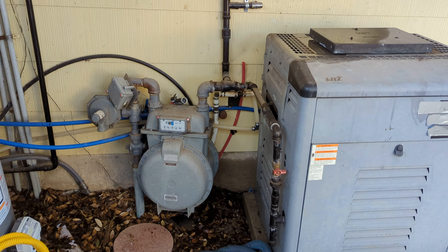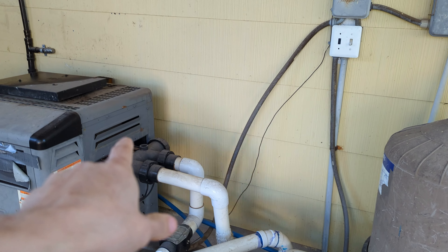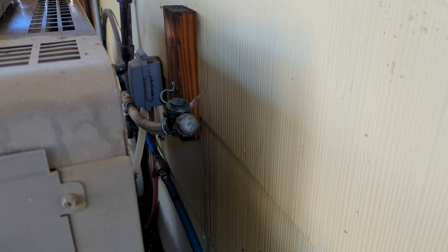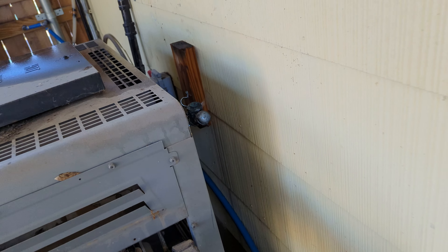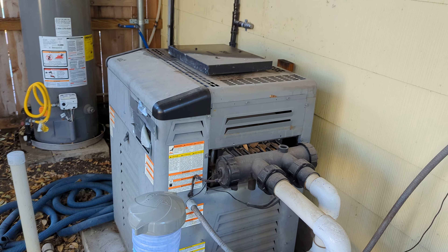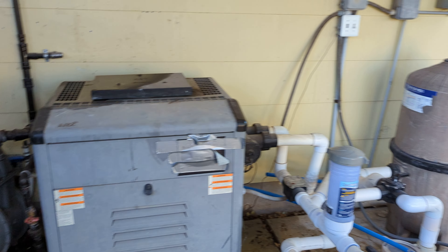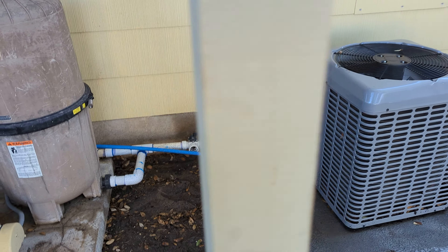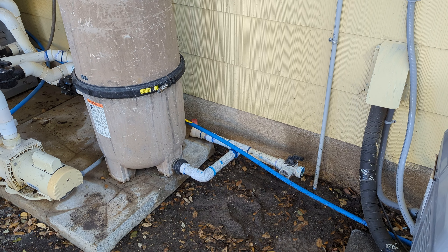So those are all the leaks here. You guys can let me know what you want fixed. For the time being, I'm just going to shut the water off from the main line at the front of the house so we can take care of that leak that's happening there, because that does not have an off valve as far as I can see. That's all puddling up right next to the foundation also. Let me know if you guys have any questions or need any other details, or need me to look at anything else.